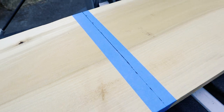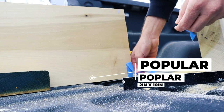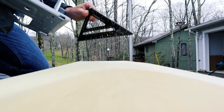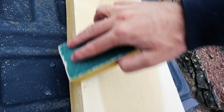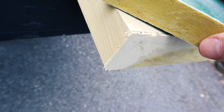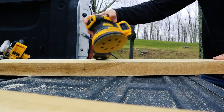For the sake of this video, I'm just going to show you how to do this bottom shelf and then quickly do the top shelf without much commentary. I'm going to go outside and get the lumber prepped. I measured the length I want my shelves to be and applied some tape to where I'm going to cut, which helps make a cleaner cut. I'm using poplar here, which is quite popular — it looks good, it's lighter than other woods, and is fairly cheap. Both shelves cost about $60 total for a 10-inch wide board. Check out floating shelf prices online and you'll pay way more than that for some cheap junk. I'll start sanding with a block to take off the bigger splinters, then sand with 60 grit sandpaper and come back with 120 or 240 grit for a smoother finish.